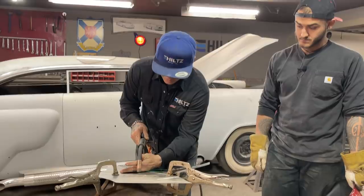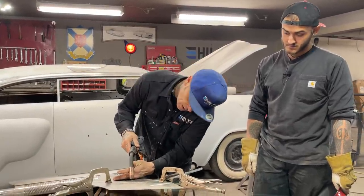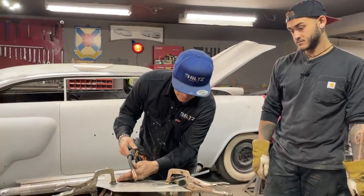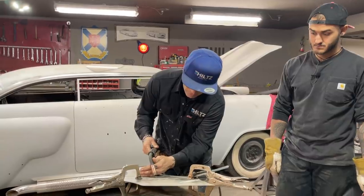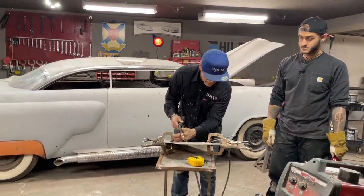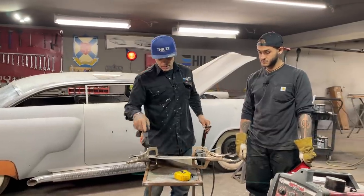You don't want to put it like this and you can't see your wire. Like I can't see my wire right at the present moment. That's why you put your head to the side or turn your welder just a little bit. Then I can see what my wire is doing. The wire has to stay in the middle of the puddle. As soon as you pull it out, it's not gonna work for you. It's gonna make splatters. So Zach's gonna go all the way along there, just doing spots one at a time